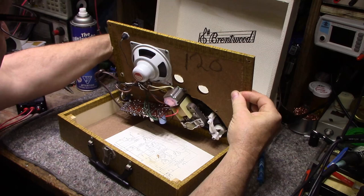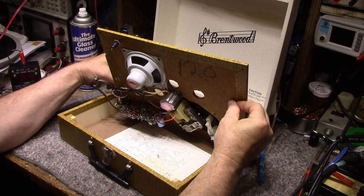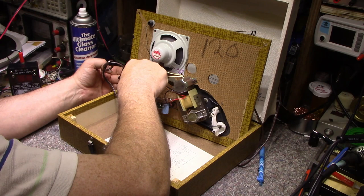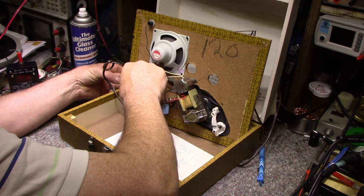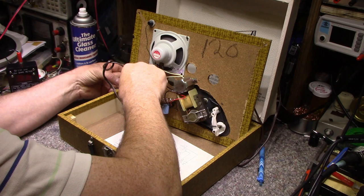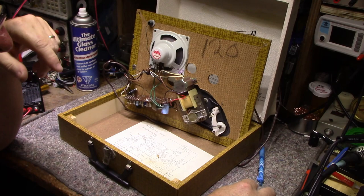Where's the volume? I turn this on. And to pull out this so I can scratch the needle. Jump this here. Still getting nothing. Still getting nothing. I think I got a dead transistor here, because those two capacitors, one of the capacitors is a problem, but I guess I got a transistor bad here. So let's shut this off and on.